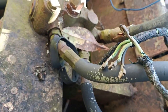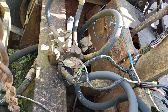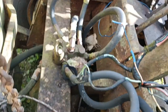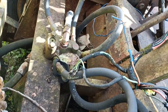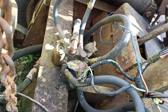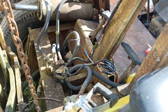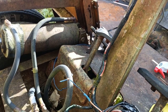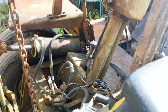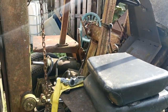I'm going to have to seal off those wires there — apparently they went to lights or something that have been disconnected. The guy I bought it from just disconnected the lights and left them unplugged, so we'll have to generally clean up these wires. Also, the brakes don't work right now, so we're going to have to get the brake master cylinder replaced. I'll update as we get some progress going on the forklift.